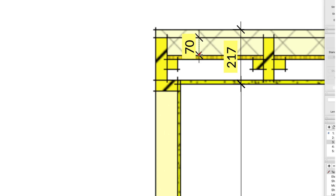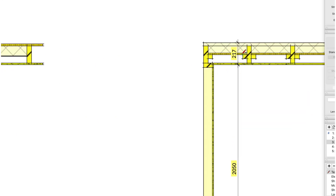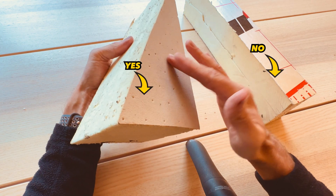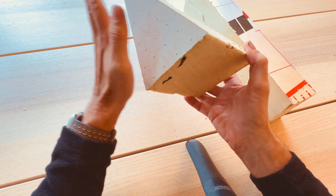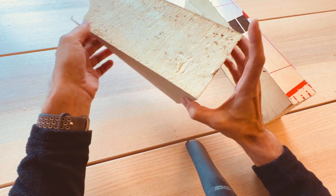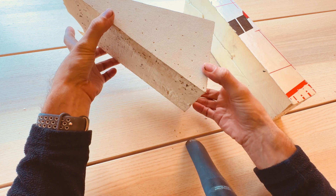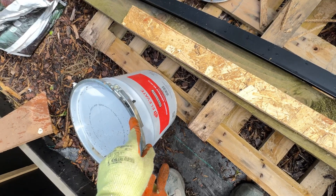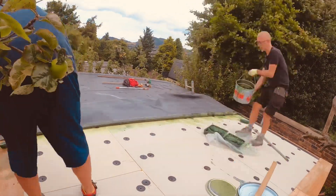Here are the kinds of heights you'll be getting from your finished floor level, and for timber suspended floors you'll be around this height off the ground. We'll be using tissue-faced insulation because we're going to be bonding our rubber membrane — the EPDM — directly onto the insulation using contact adhesive. Because we want to avoid foils outside our vapor barrier specifically for our roof elements, we'll be applying the adhesive to both the rubber and the insulation so it grabs together. We just need to wait a little bit for it to get tacky — it's a little more tricky than using the water-based method and gluing onto a timber deck.